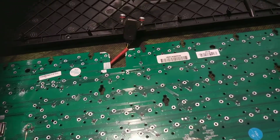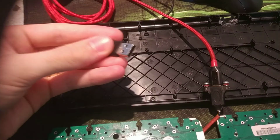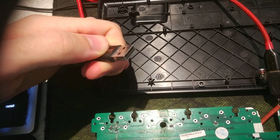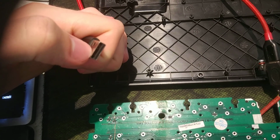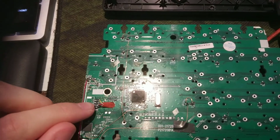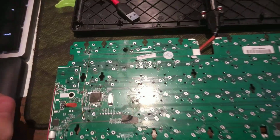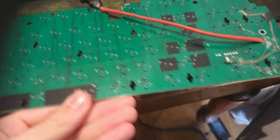So you have to test how it's routed down there, and you can do it fairly simply with a simple USB cable. You put your beeping multimeter into this and touch each of the 4 connectors, and you test at which cable it's beeping. So it's a proper hard job. I don't know how you say it. And I hope I finish today.